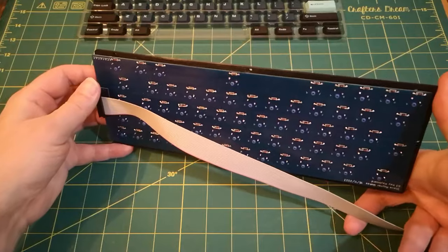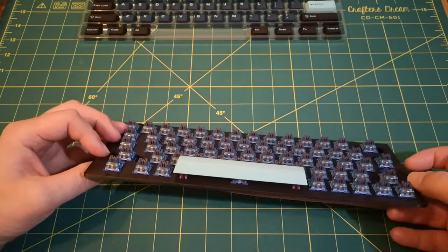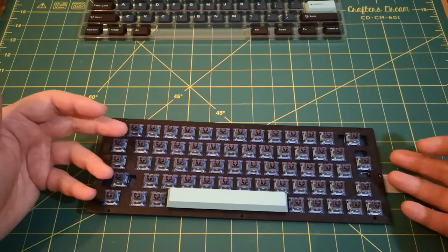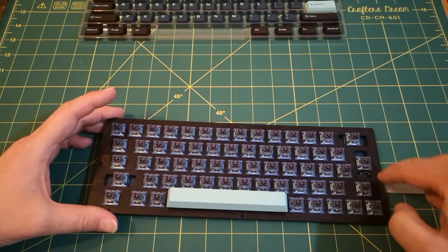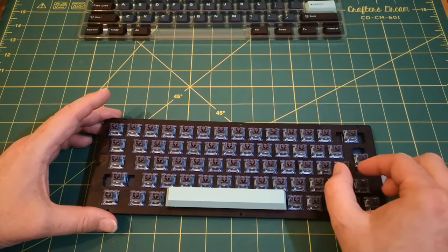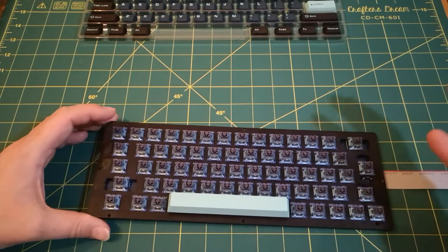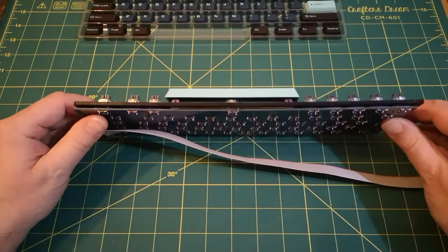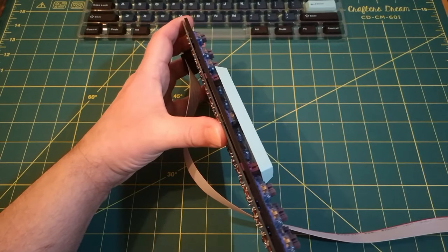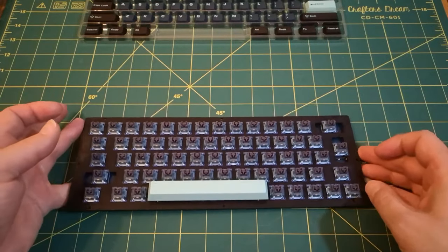It just seems to be an unfortunate side effect of how the PCB is attached to the plate and the switches. I did initially think maybe the tolerance is slightly off by the tiniest of amounts, and I actually took all the switches out and filed out all the square holes so that there was a very slight piece of sideways movement in each switch. But I think it didn't help. I reassembled everything and it's still bowed. But like I said, it's only the very slightest amount of pressure to pull it straight. So I think once it screws into the case, it's going to be fine.